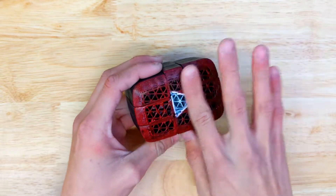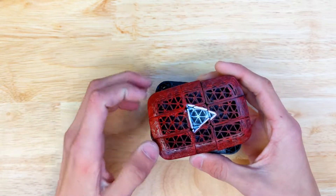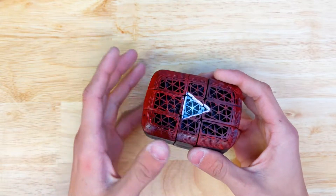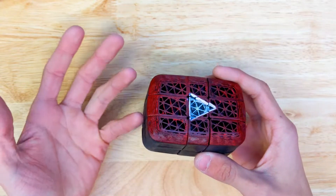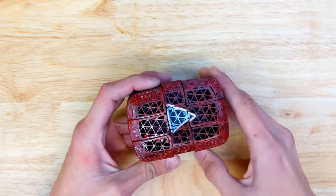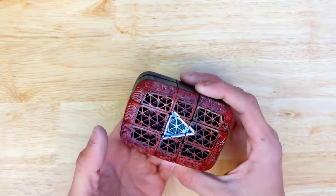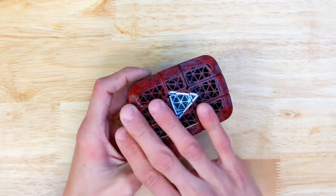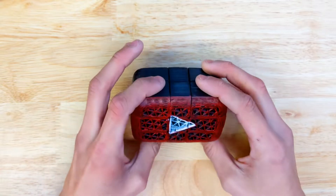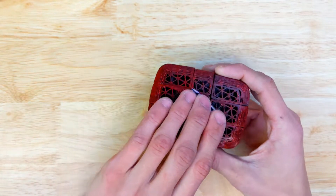I split it with some surfaces. I didn't actually put the holes in the CAD file — I did that in my slicer. I'm going to put the files up because I feel like sharing this design. I put the top and bottom layers at zero so it doesn't print any solid layers, then used triangular infill at a decently high density so it would have a nice pattern and still be strong.